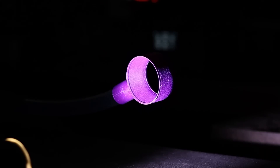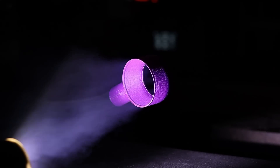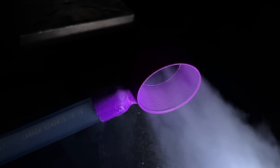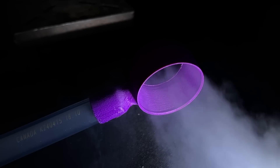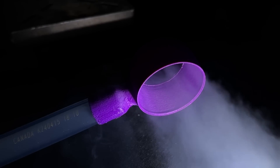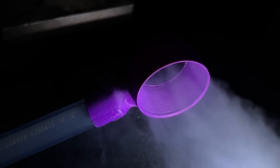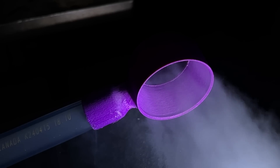Now I've changed the smoke to come in directly from the fan supply side. We can see a nice smooth flow, and also some turbulent interaction out front with the air around it as the cone shape gets larger. It's a little tough to tell, but the duct is not perfectly balanced — more air at higher speed is leaving from the side opposite the fan supply.